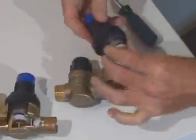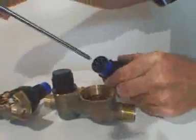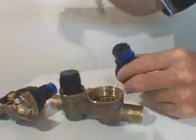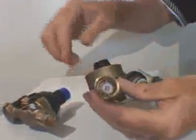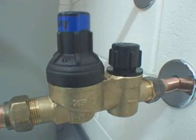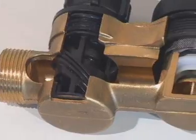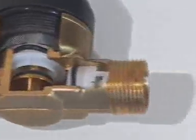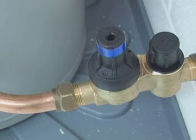The LSV has four functions. It provides an isolation valve, a 250 micron filter to protect the system downstream, and an adjustable limiting valve to allow for accurate pressure control. It also incorporates a non-return valve in the outlet to prevent any backflow from the hot water service. The limiting stop valve is adjustable from 200 to 600 kPa and provides a very high flow rate. For future maintenance, the limiting stop valve can be isolated and left in line — you simply remove the cartridge, which contains all the working components of the valve.